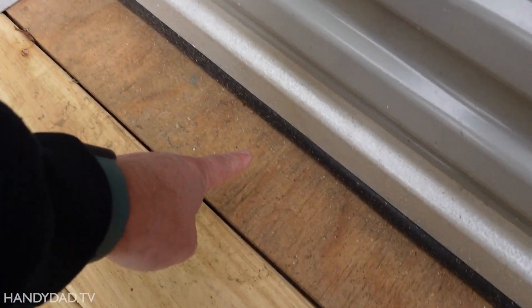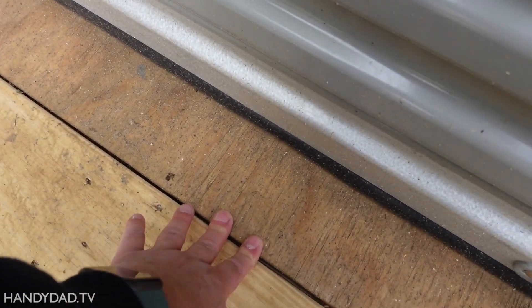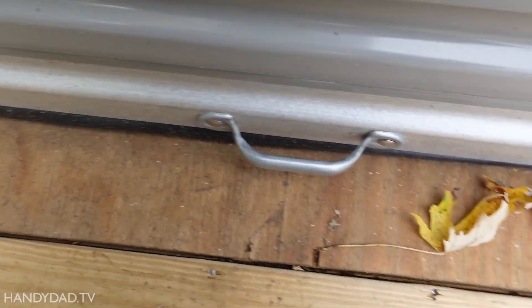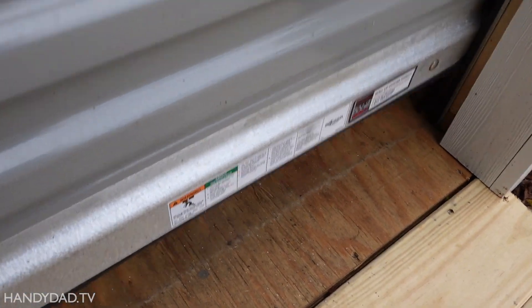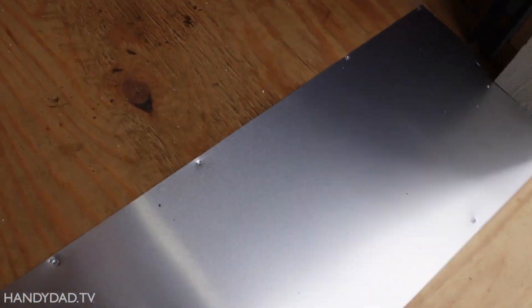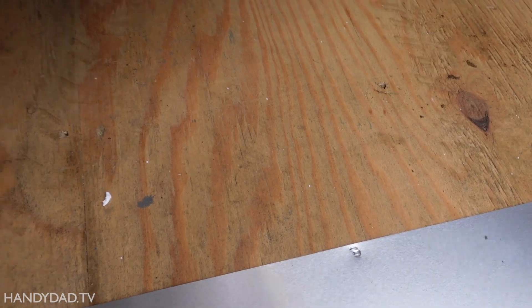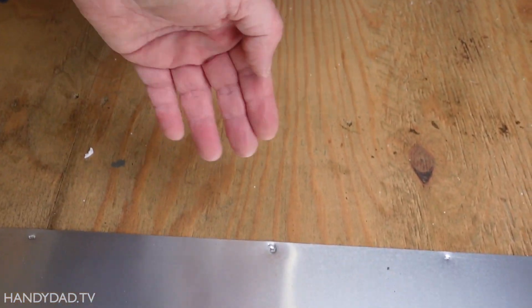One of the things that concerned me about the roll-up door was down here — the fact that the door is on the inside of the shed. This is the shed floor, and that's not pressure-treated plywood. And even if it was, pressure-treated plywood can still delaminate over time because of moisture, rain, and all the elements. You can even see how the water has been wicking in here. So a piece of flashing, some staples, and a little bit of clear caulk — I only caulked the top edge, just in case he pulls the mower in while it's wet. No water will get underneath there.